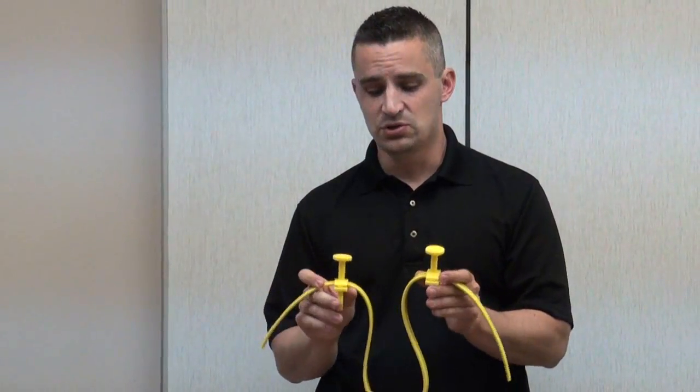The loops that hang down in low headroom applications like workstation cranes cause a risk factor of getting caught on a piece of equipment and potentially yanking the wires out of your hoist. When competitors do longer systems with multiple bridges, they do an outbound conductor bar system where they stack up multiple conductor bars. But with workstation cranes in low headroom applications, you have the risk factor of exposed conductor bar inside your shop, which always provides a risk factor for somebody getting shocked. Overall, this type of system is a very cheap solution to bring power from your source over to your hoist.